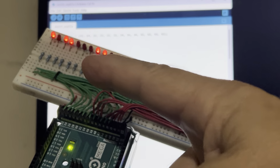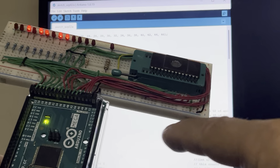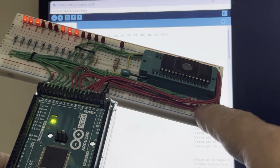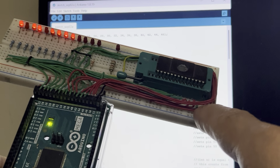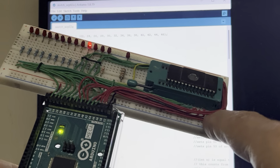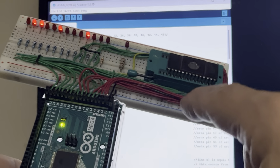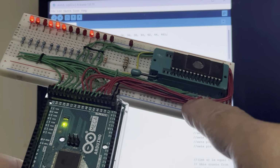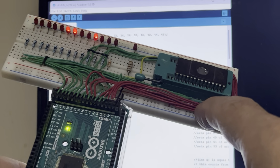But anyways, this is scanning in byte form because it's accessing the address to cause the EPROM to output its data on these red lines, which are 8 bits, so that's 1 byte. But each one of these bits is being analyzed by the program. So even if inside the byte there's one cell that's gone bad, it'll show you that.